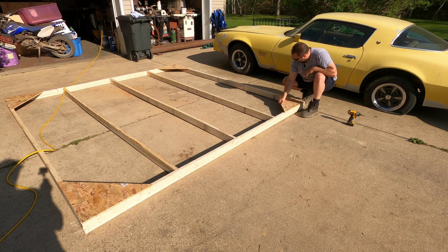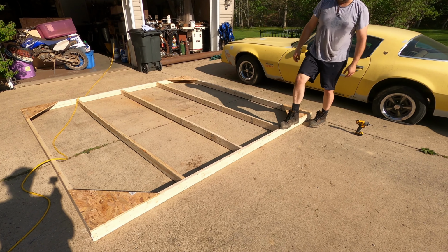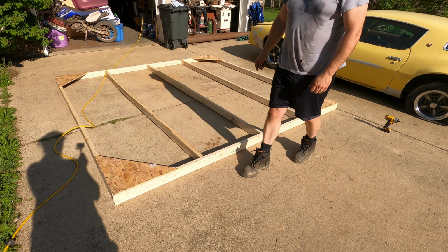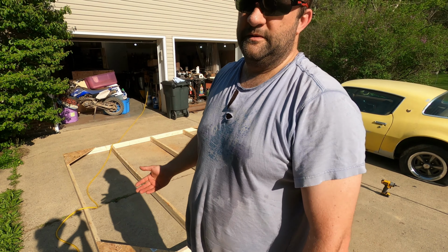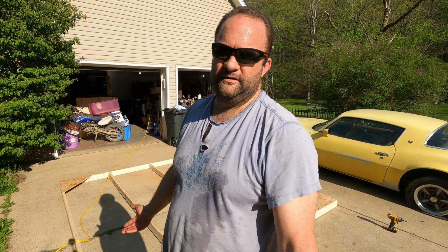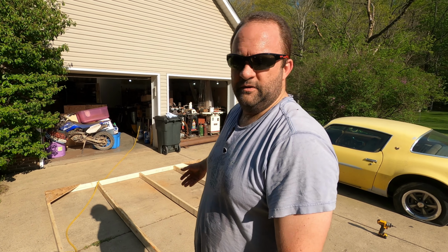So what do you have to put bracing in? I'm going to cut 4 more and put them on the interior. Okay, on these 4 inside. And then when we screw, the problem is we're going to use plastic roofing. Yeah, so I don't want that roofing to carry the load because it'll break. Right. And I don't want to sheet the whole thing with a piece.